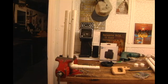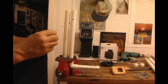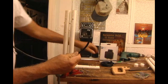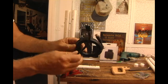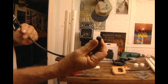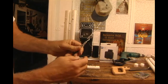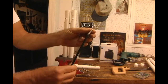And I will show you in a minute how to make your attachment wire. I've already got one pre-made. This is part of this wire. You buy the shortest piece of wire you can. Again, it's RG6. You're going to use this end. It's going to attach right to your amplifier, and this end is going to be your pickups. As you can see, I trimmed it back.